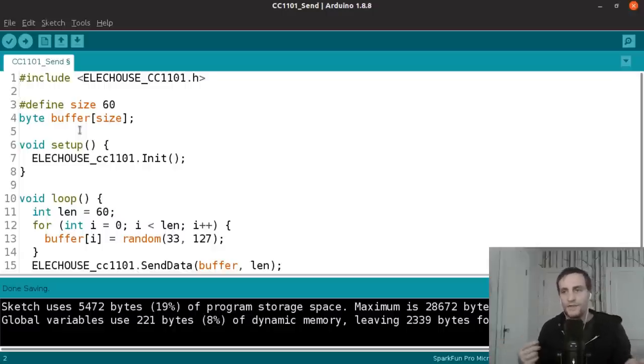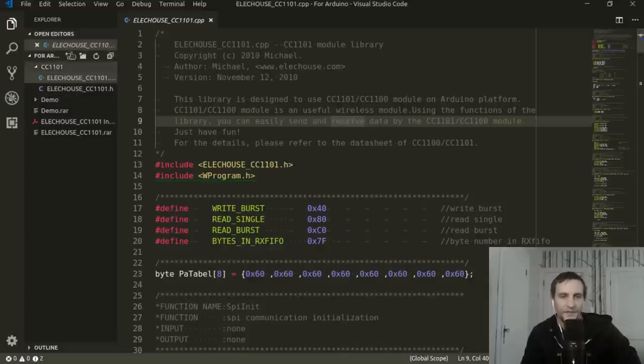And I'm communicating with that chip using a library called ElecHouse CC1101. I'll go ahead and put a link in the description to that library. Basically you just download the code, unzip it, put it into your Arduino libraries folder, and then you can include it into your projects like this. I can show you what that library looks like first.